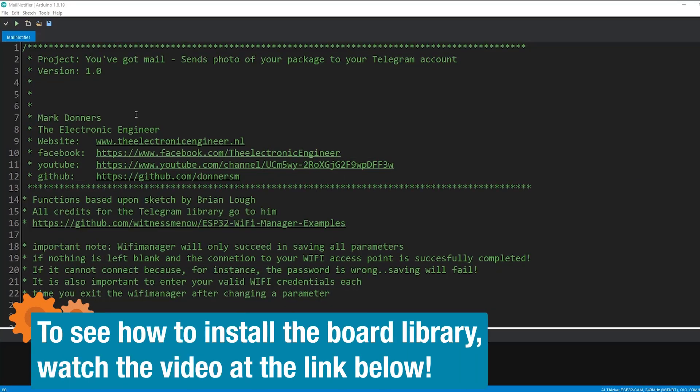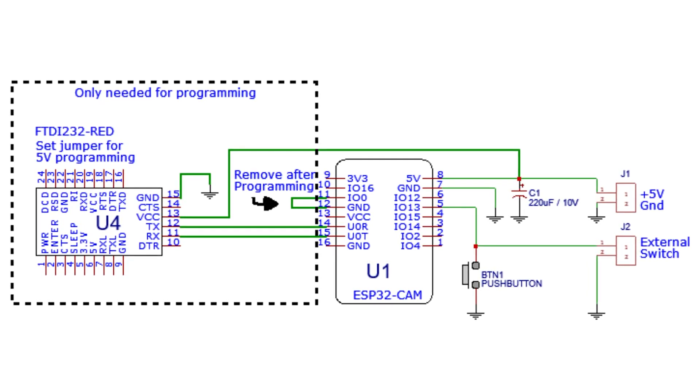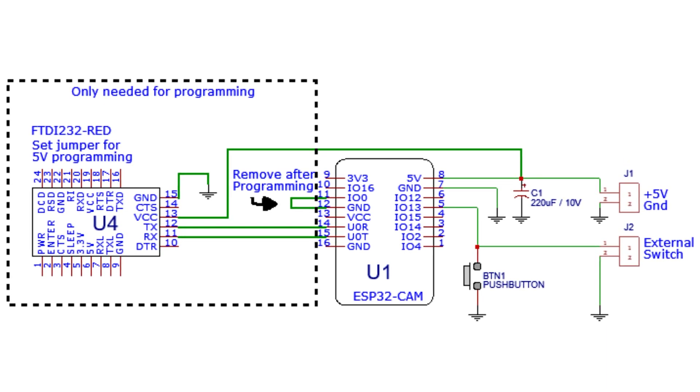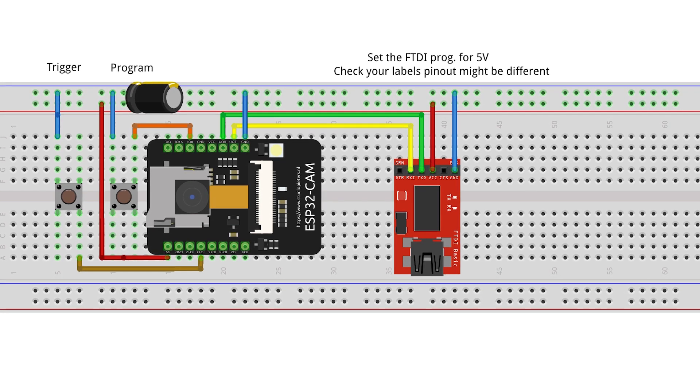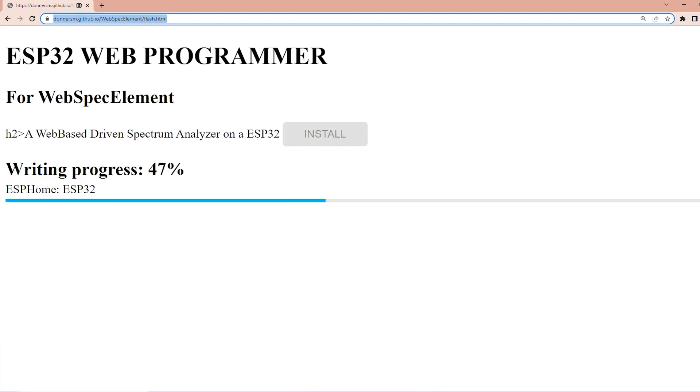If this is your first time using the Arduino environment with an ESP32 board, you will have to install the appropriate libraries. Programming the ESP32 CAM is a bit more complicated than the ESP32 DevKit 1 because the ESP32 CAM module doesn't have onboard USB — you'll need an external FTDI programmer. You also need to set a jumper on the board, or connect IO0 to ground to enable programming mode. I did create a possibility to program your ESP32 CAM using a web browser — I'll put the link below if you want a quick build without changing firmware.